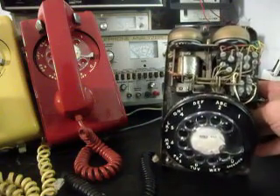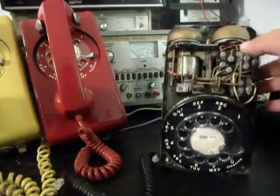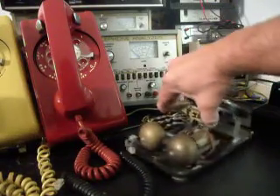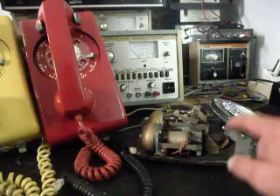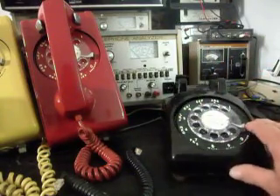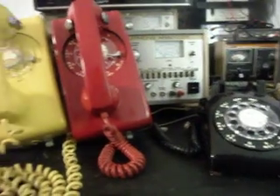It's a very cool telephone. All three of these phones have the early model network and the early model bells for this period of telephone. The modular line port is installed, but it's missing its modular port for the handset, so we'll be installing one, going through the rotary, cleaning up the telephone a little bit. That's a really cool desk phone, and you're never going to get anything like it again — they're just not going to make anything like them.